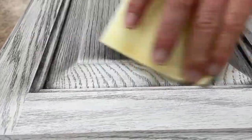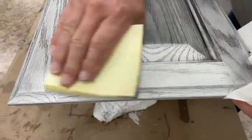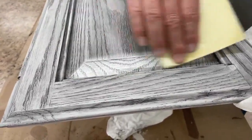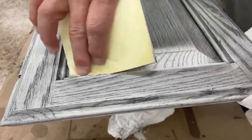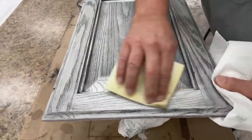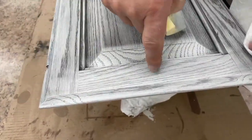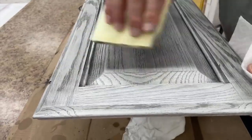Let's do the other end — the cross grains first. Remember we talked about the cross grains. We do that even in the sanding of our paint so we make sure we don't have any cross grain marks. I always sand with the grain when sanding my doors after I assemble them — same way. I always sand with my grain, doing my rails first and then my stiles next, and then on my panels end grain and then long grain.